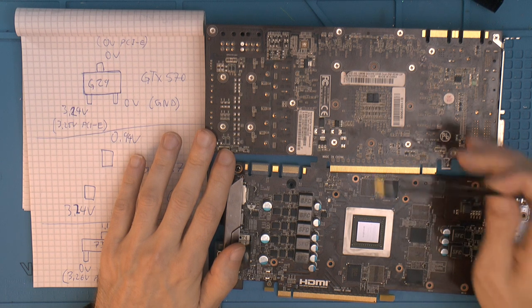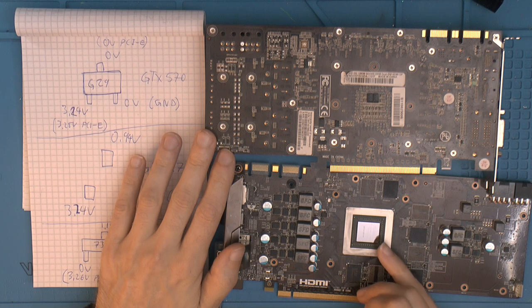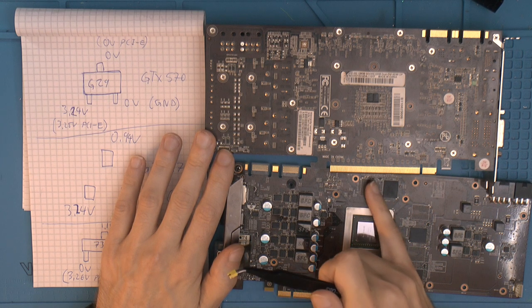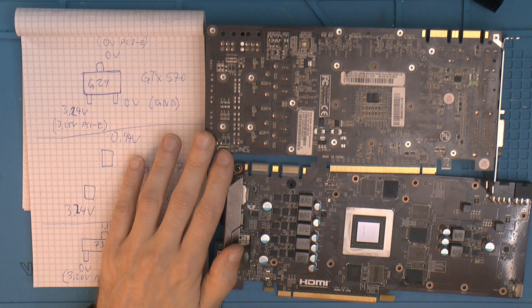So actually, like I said before, I had voltages for this because I measured this card. I also measured this one with a small heatsink on it. It doesn't run particularly hot, because 4 out of 5 times it doesn't get proper voltages everywhere. But I put a small heatsink on and measured it, and got pretty much nothing on these. So the ground obviously should be 0 volts, but the 3.24 volts were not there. The 0 volt was 20% of the time at 1.1 volts. But I figure that might be explained by the fact that there's no 3.24 volts present.